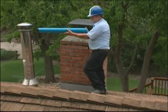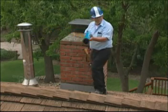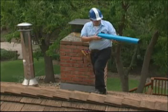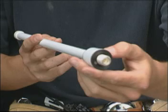Directional antennas can be vertically or horizontally polarized. Rooftop will always use vertical polarization. An omnidirectional antenna, which will be used in this installation, is vertically polarized and therefore can only be mounted vertically.